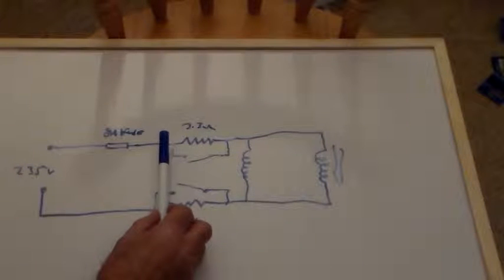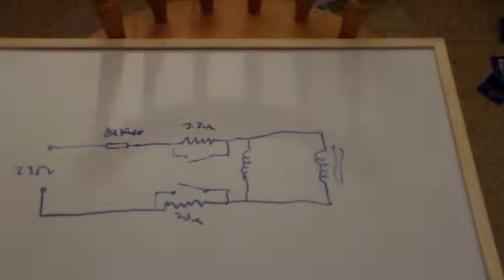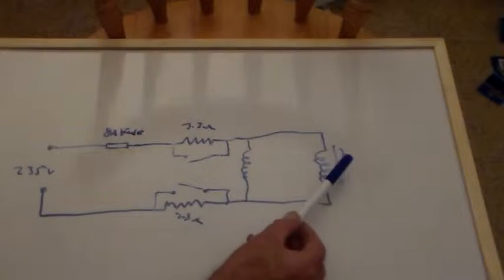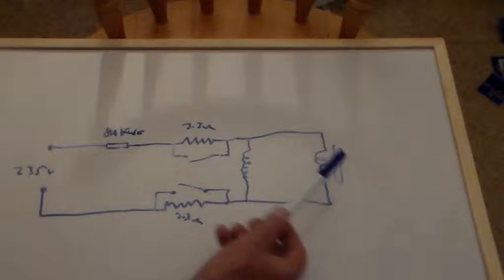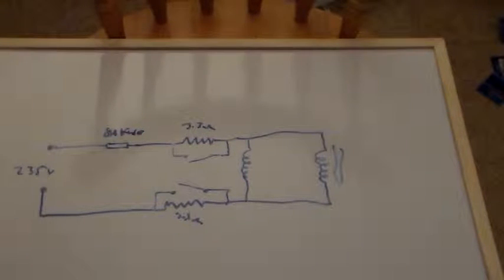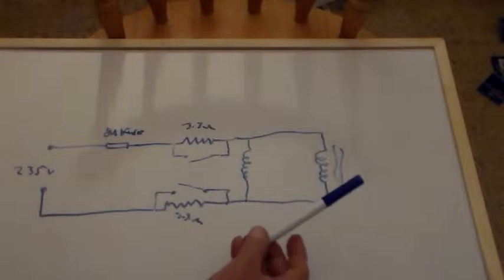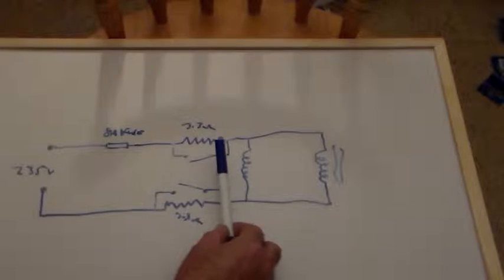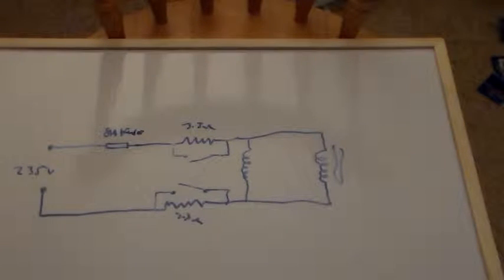And yesterday I said there was 6 volts dropped across those resistors, and I'm sure you're wondering why on earth I'd worry about that, because 6 volts here is only going to equate to, I don't know, 50-60 volts there, maybe a bit more on the HT rail. But the reason is that these resistors can't be in here when the amplifier is operating, because they'll try and limit the current. When the amplifier is running power, these things will burst into flames. They will turn themselves into stalks, and my amplifier will sound like a box of cornflakes. So the inrush current limiting resistors do need to be switched out.